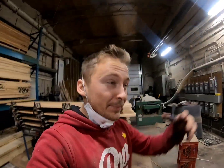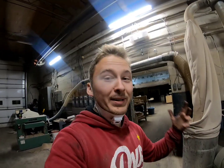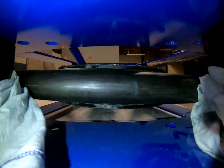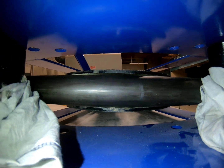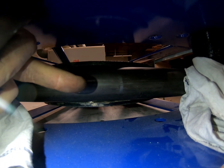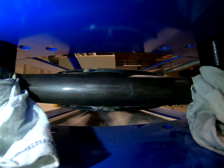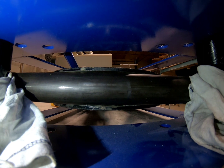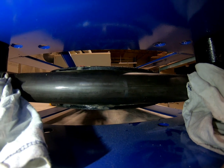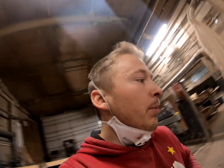Yes, this is hard, but it saves you money if you want to do it yourself. There's the mark I made and there's the center. Right in the center of the die is right here, so I'm starting about an inch and a half to the left — so I have to finish an inch and a half to the right. I'm going to do 15 pumps, and if it gets really hard to pump I'll do less than 15, because if you force things you're going to break things. Let's start there and see what happens.